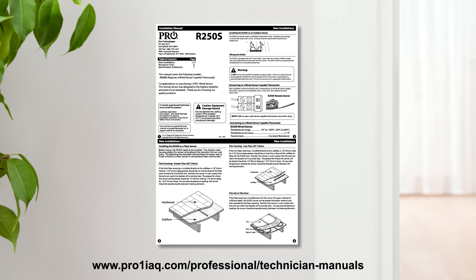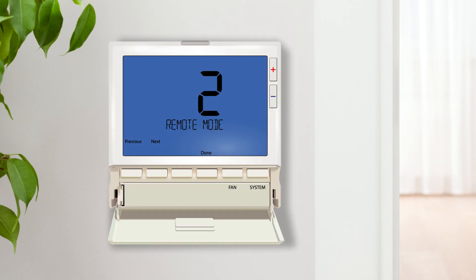Adding a temperature sensor in the slab itself greatly improves system performance. When you are ready, return to the remote sensor operation setting on your thermostat and select option 3. Floor temperature displays the current temperature reading of the slab sensor installed in the floor; if the slab sensor is not installed correctly, this screen will be blank. The floor high limit setting allows you to set a maximum floor temperature limit for heat — once the floor hits this limit, the heat will be locked temporarily regardless of the air temperature. The floor low limit setting allows you to set a minimum floor temperature limit; when the floor temperature reaches this temperature, the heat will turn on automatically regardless of the room temperature.